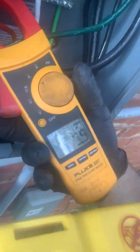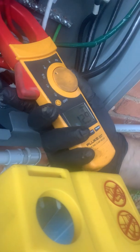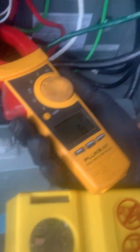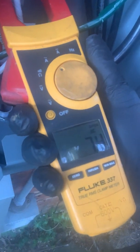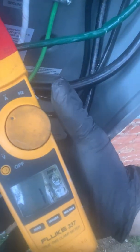The AC is off right now, so I'm drawing about 10 amps. When the thermostat decides it's time for AC again, that load will come back on. On the other leg and the neutral return, I've got about seven amps — so we're a little unbalanced between the two legs.